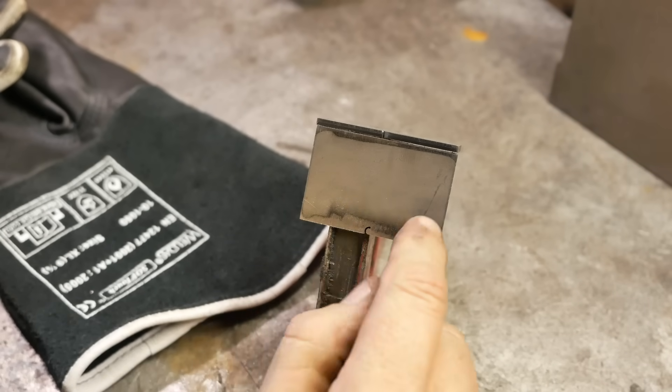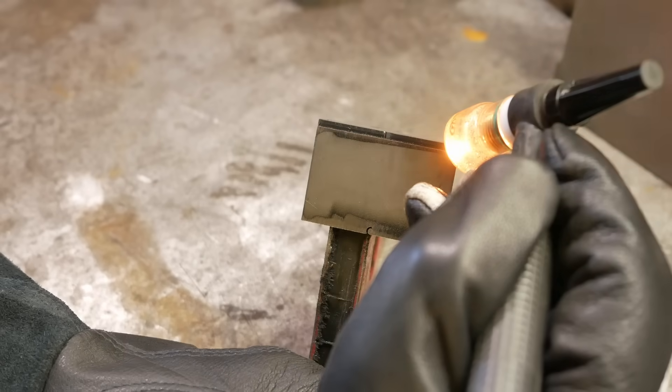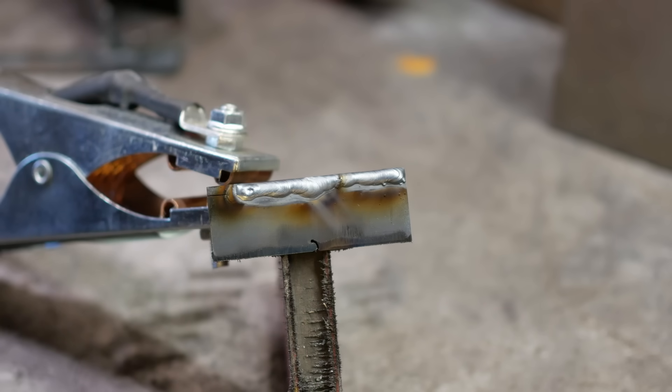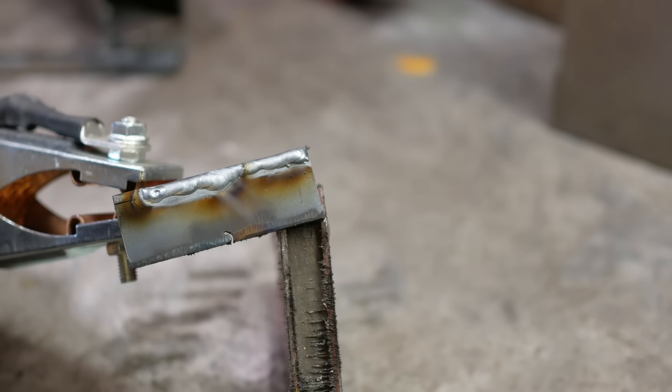Before I start tacking up the real thing, I've got some pop-outs from the laser cut parts, so let's just do a couple of test tack welds on them. That was 60 amps — let's just crank that up a bit. The next bit I'll try with 75 amps. So 75 amps has given me a slightly bigger weld — I kind of wandered a bit that time. What does the backside look like? I can see a little bit of penetration there. Let's start fixturing this thing up.